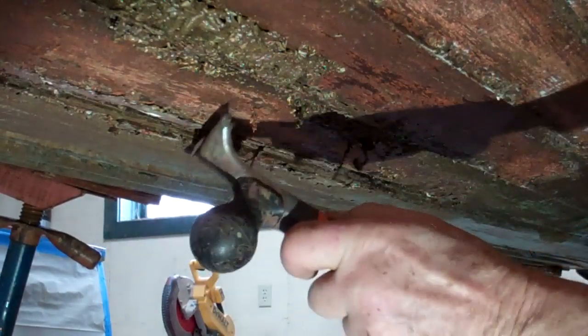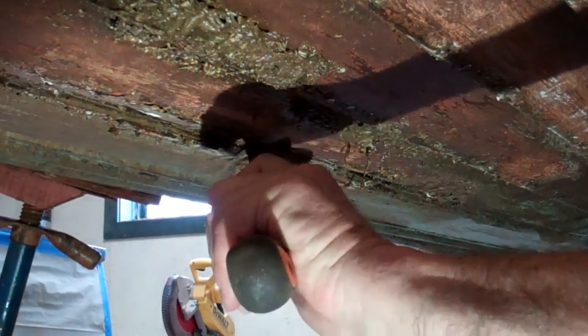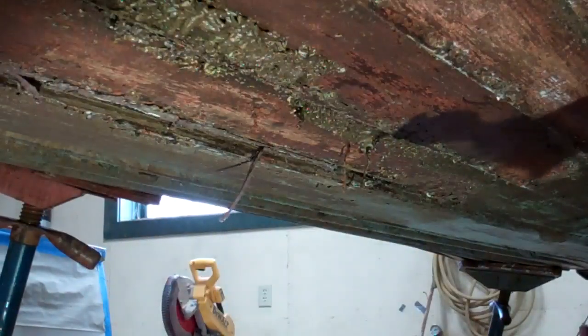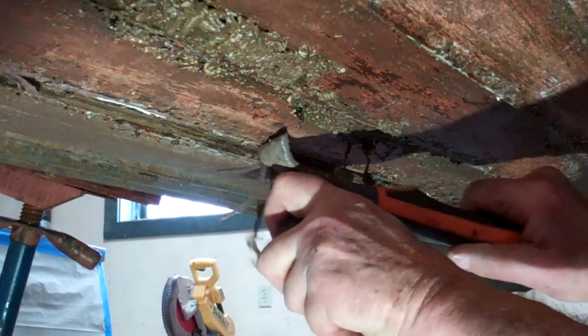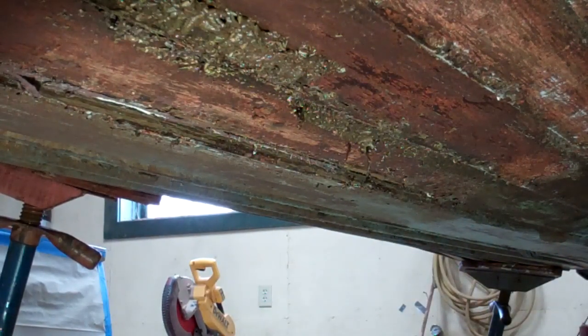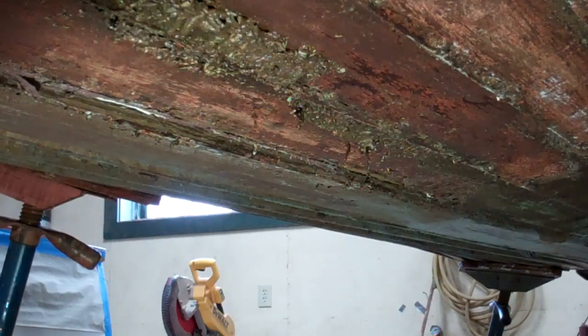I've been doing some research. We would normally caulk this seam using Interlux seam sealer for underwater applications, but you can see this stuff is just not adhered at all. Going back to that topic, we have really pretty much specialized in using the Interlux seam compound. The problem with the seam compound, and I'm sure there are those of you out there who will agree with me based on your own experience, is it's just plain no fun applying it. The stuff doesn't trowel out nicely or at all. It's difficult to force into the seam.